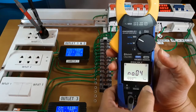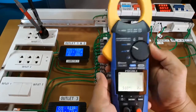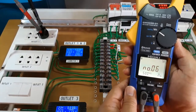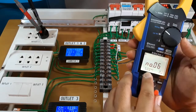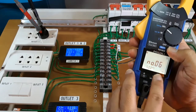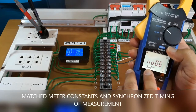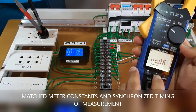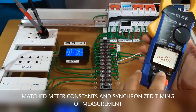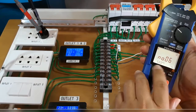What we are interested in here is 500 cycles per kilowatt hour, because this matches the meter constant of the energy meter we are going to use for this experiment. The values here are adjustable and I can change the meter constant from 500 cycles per kilowatt hour, but that would not be the same as the value in the energy meter. So we will return it to its default value of 500 cycles per kilowatt hour.